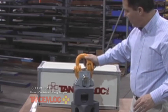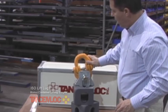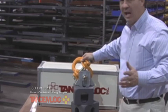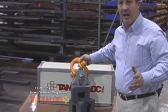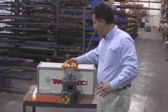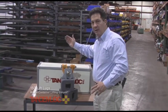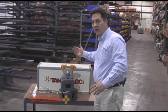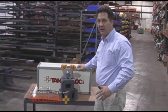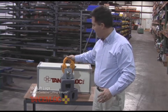Once it's in there, you're ready to lift. The chain connecting link will move to the angle of load in both directions, so it is designed to handle a compound angle type load. It's rated at 11 tons when used at a 60-degree angle, and also at 9 tons when used at a 45-degree angle, which is the minimum angle you're allowed to lift from the top. In every way, this product meets the ISO standard.